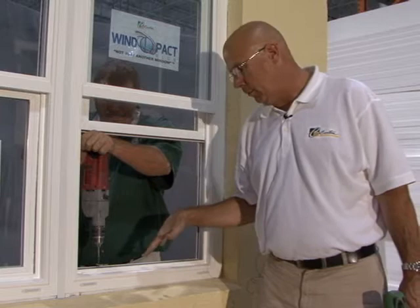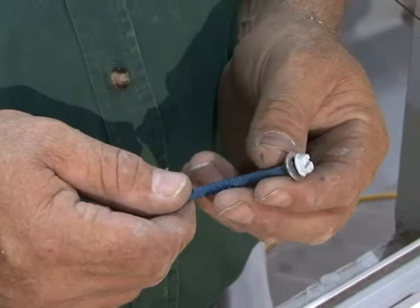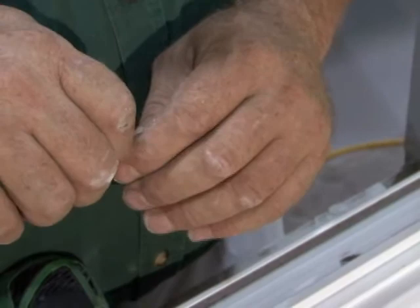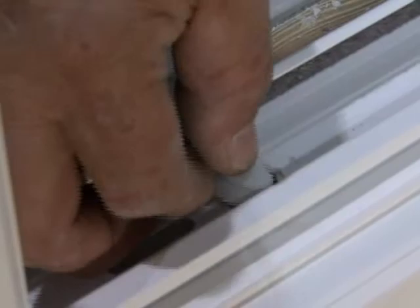What we're doing now is drilling holes in the bottom of the sill of the window. We have a three-quarter inch hole, then we drill our hole for our TAPCON. Drill the hole, back it out, blow it off, fill the hole with caulking, put our TAPCON in, and then put caulking over the top. We have a three-sixteenths TAPCON going in the sill of the window only. It has a half-inch stainless steel washer backed up with a neoprene on the bottom to help get a secure seat. We caulk the holes, install the TAPCON, and caulk the top after it's secured. These special TAPCONs with the washers and plugs are included with every window to go into the sill only. The last step is to cover the TAPCON holes with three-quarter inch plugs.